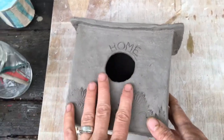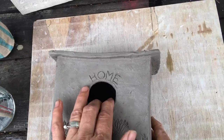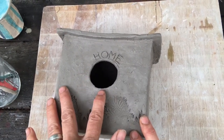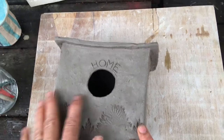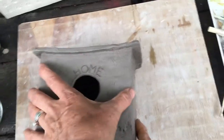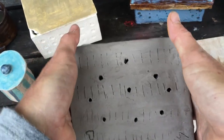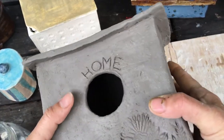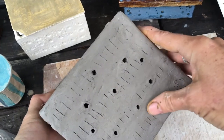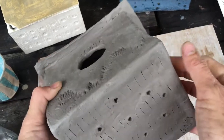There are different size holes for different species of birds. They all have a preference because they want to get in, but they don't want their predators to be able to get in. Some like a little stick to perch on while they're feeding their babies, and some hate that — they'll pull it out if you keep putting it in. Other important things about this home are that the bottom has holes in it. If it rains and you've got your windows open, you're going to get water in your house, so it needs to drain. You don't ever want it to fill and just soak. A lot of people forget this, so you always want drainage at the bottom of your birdhouse.